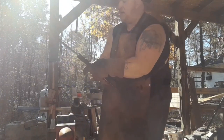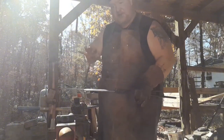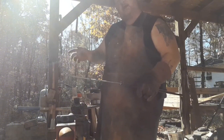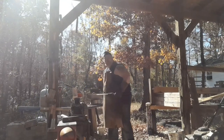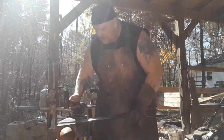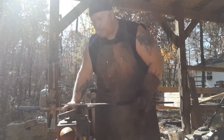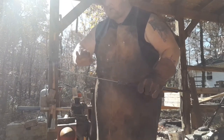The next process is annealing. I'll get the blade all the way up to temperature inside the forge, seal it off in there, and let it cool overnight to get the metal nice and soft. Now we're just going to touch up the tang and make sure it's good and straight.